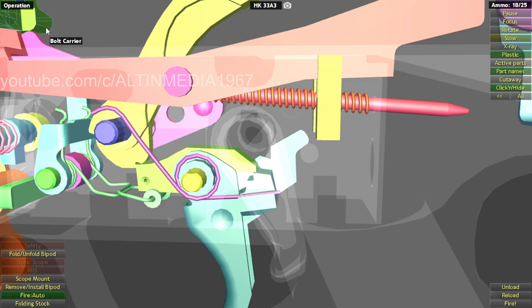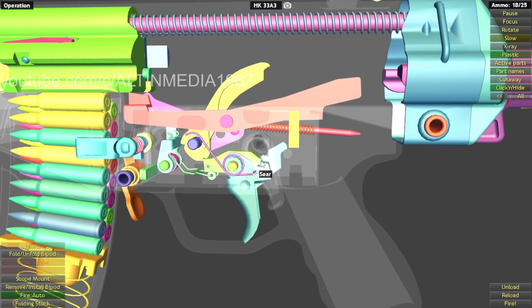When the release lever is being pushed down by the bolt carrier, it creates perfect timing for continuous full auto firing — as long as the sear does not engage the hammer at all. So when you pull the trigger and keep holding it, the auto will continue. Because that's how the system works in the G3, which is HK design — G3 and MP5. So the HK G3 derived design uses this similar method.